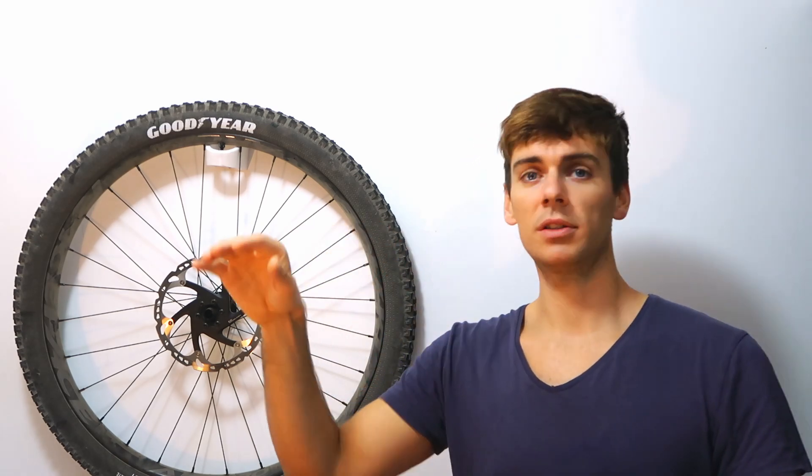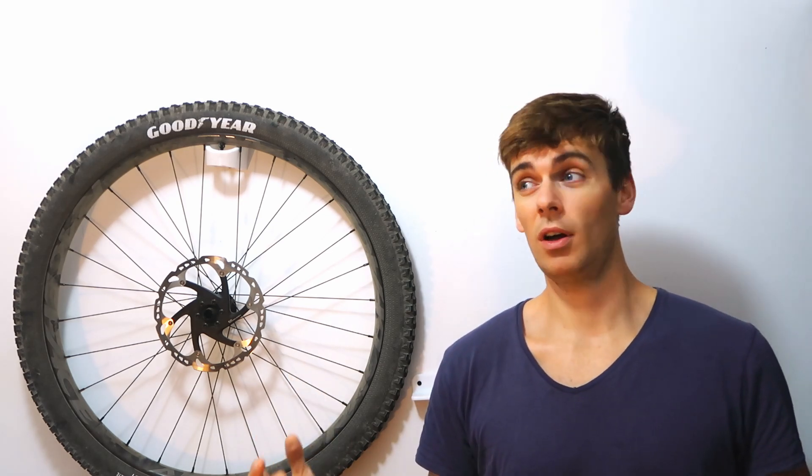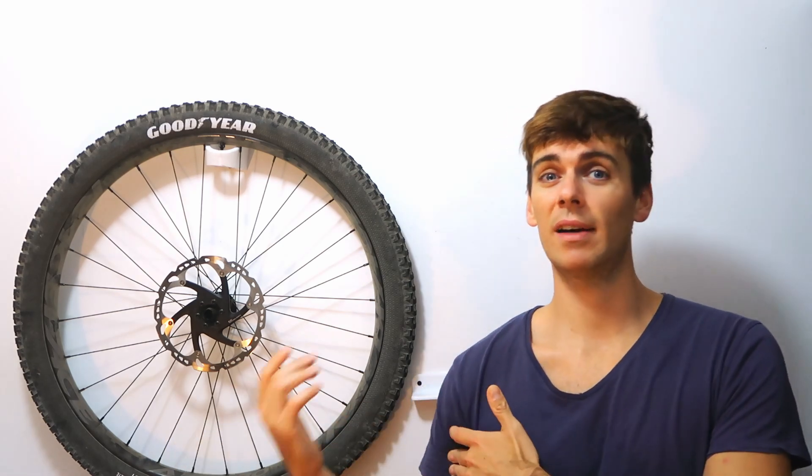The drawbacks of the voluminous bow: there's going to be more crashing on the hull as the boat takes off and lands on the other side of the swell. The composites in that area will need more reinforcement, more thickness, and more weight. It's going to be way more uncomfortable for the skipper — a lot of slamming and banging continuously, which mentally and emotionally is just going to be torture. With added speed and a wave piercer you have more kinetic energy and more momentum going into that collision.